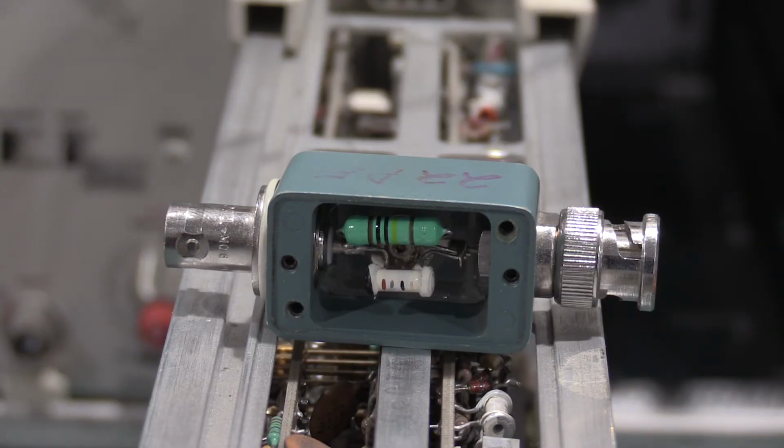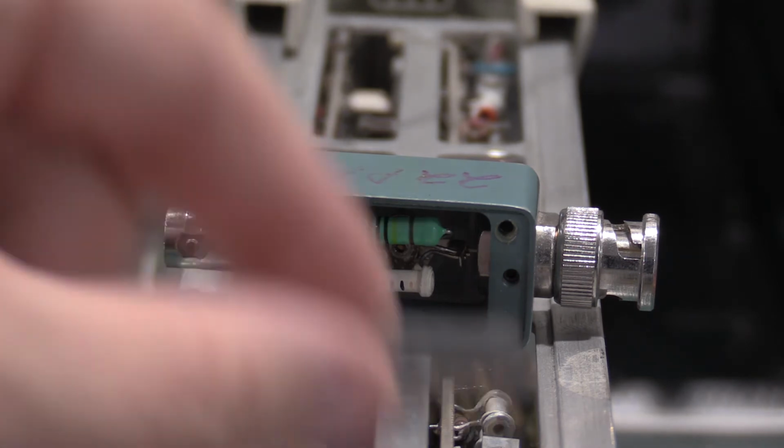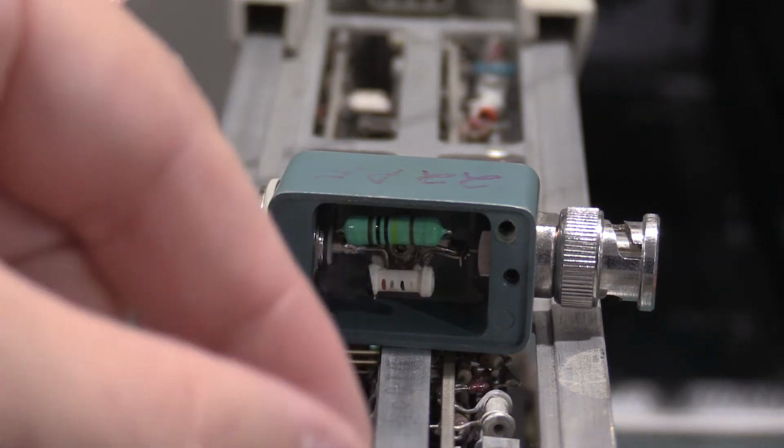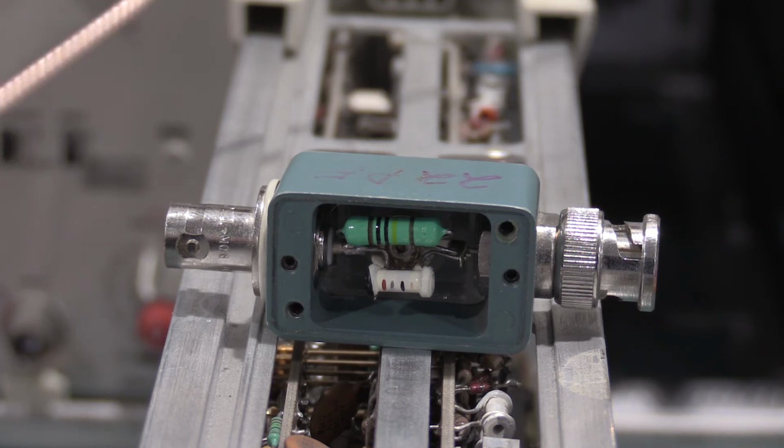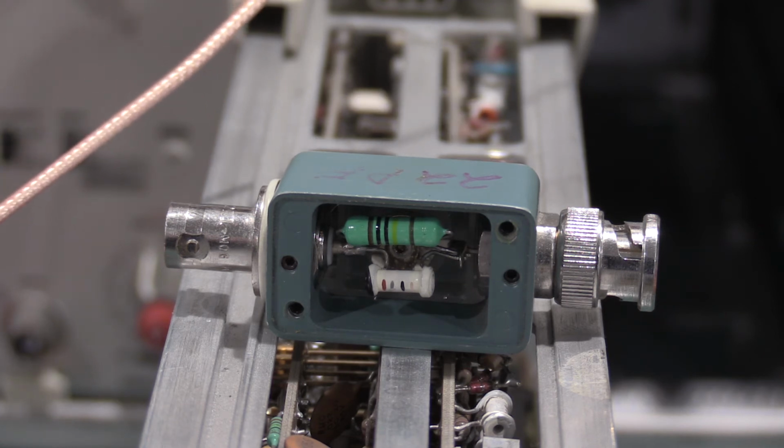I've caught the plug-in back up to where we were on step 4 after figuring out the trigger light. The trigger light ended up being a custom Tek IC that wasn't sinking enough current to actually light the light bulb up. So there's something shorted out in there.